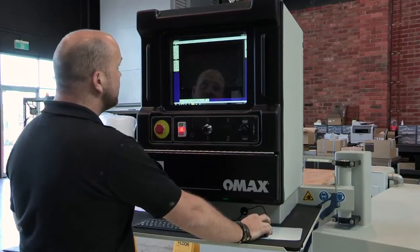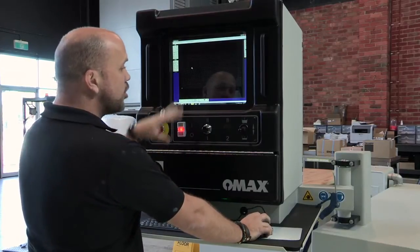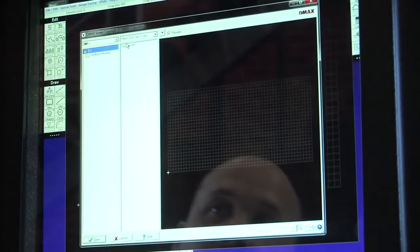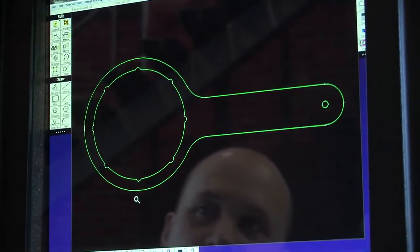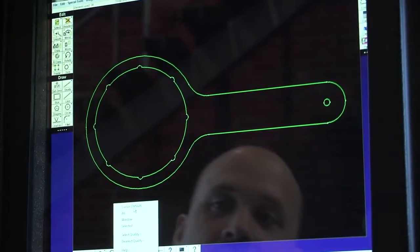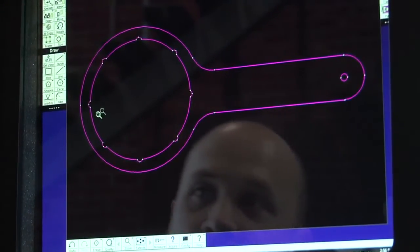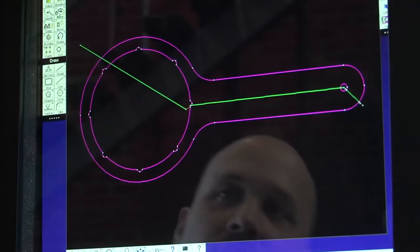Then you come to the layout side of the software. This is where all your programming is done and in no way affects the control side of the software, so you can be programming a part while your machine is cutting. I now open the parts and navigate to where it's located. As you can see — spanner. I've called it up into the software. I now need to designate a cut quality, which is the surface finish of the cut that will be left behind. Now I need to tell it where the traverses and lead-in lead-outs are. Traverses are green lines, lead-in lead-outs are brown lines.